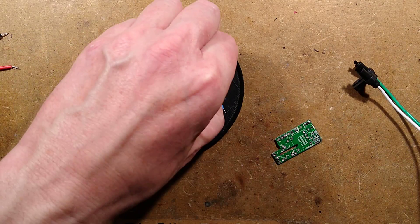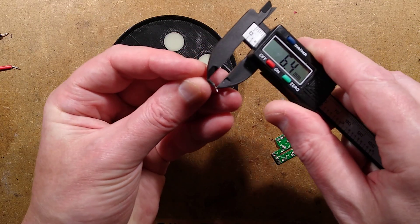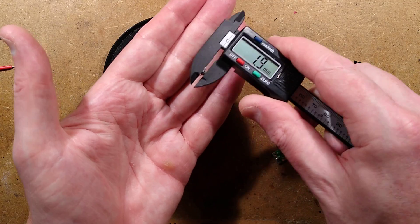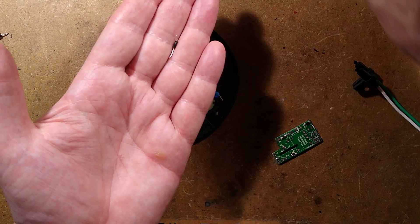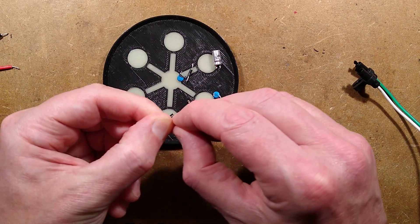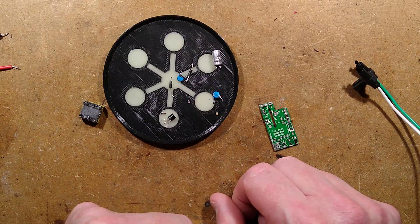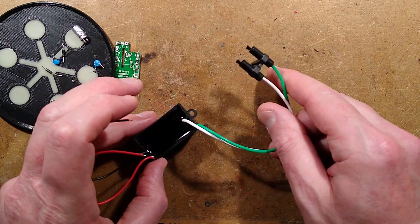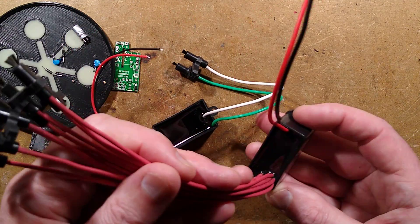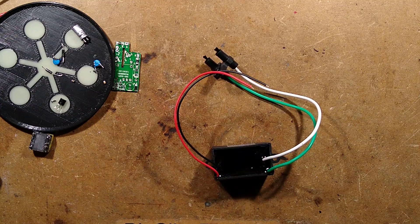I've been on AliExpress looking for those small diodes. I found similar ones, but these ones are 5mm long and 1.9mm diameter — about 5x2mm. I didn't find ones that matched that; I found ones that are about 10mm by 3mm, which is close enough but not the same. These diodes are high voltage and also rated for very fast turnoff — designed for use with high frequency oscillators. That's the most recent finding, and a thorough exercise in de-potting that took quite some time.